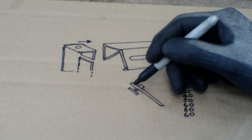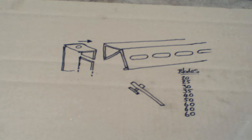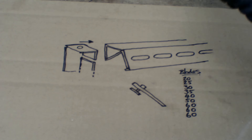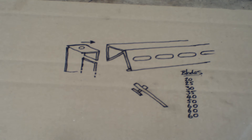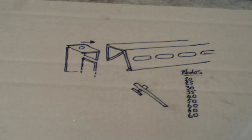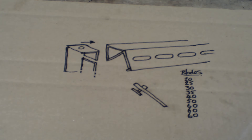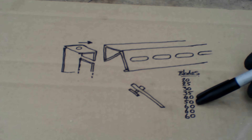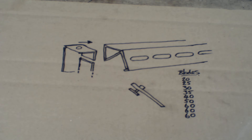This runner is basically just to align the captive fixing on the inside. So that all gets welded together and dressed up nice and neat. As far as blade widths go, I'm going to have a number of different sizes. I want to be able to bend anything up to 800mm and as small as 20mm. The blade widths are going to go 20, 25, 30, 35, 40, 50, and then all the rest will just be 60. The reason is that if I want to do, say, a 55mm box, I can put a 25 and a 30 together — butt them up nice and close and that gives me 55. And if I need 57mm, I'll just put a 2mm space between the blades. Easy enough.